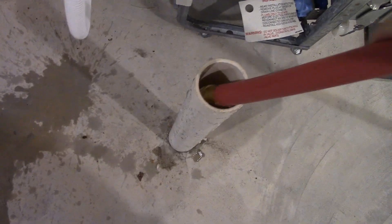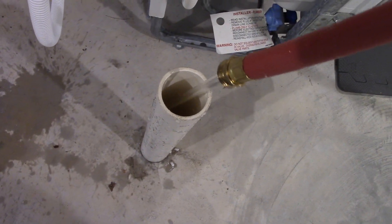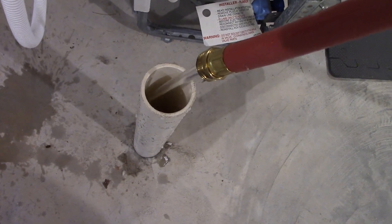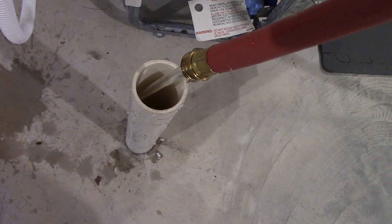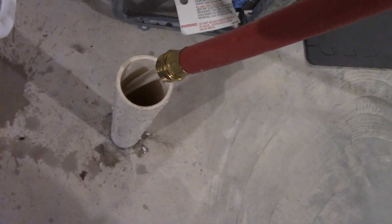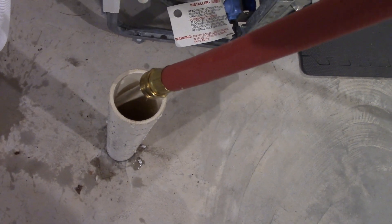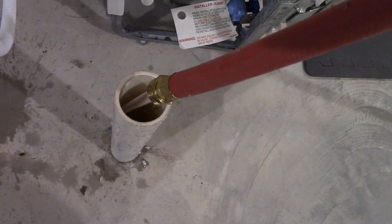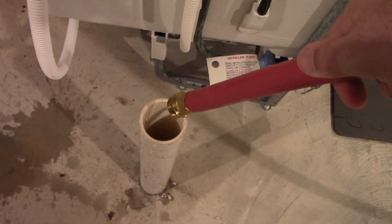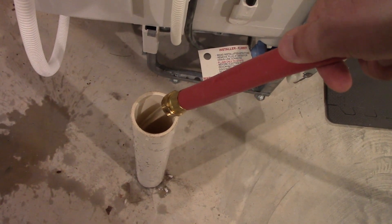And if you have any water alarms like I do, move those away just to be totally sure. A little bit of water spilled out, but that's okay. Well, if I'm honest, that water looks very clear. So that's certainly a good sign. Alright, so what we're going to do is basically just let this drain. And then once it becomes too much for gravity to handle, we'll move to the sump pump and I'll tell you about how to do that system. You also want to be patient because these water heaters are very big tanks, so with this kind of flow it is going to take a while for the water heater to drain.